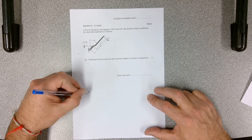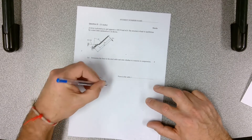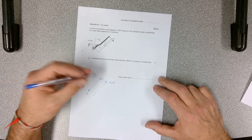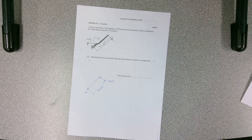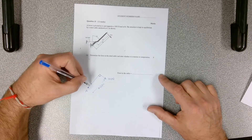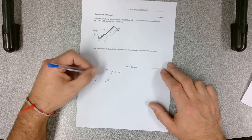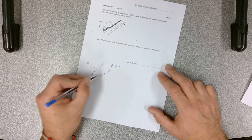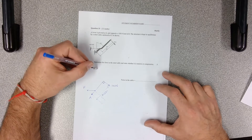We can do a free body diagram to simplify it. Our pivot point is point A — that's our lever. Our force is 100 newtons and it's at right angles to the lever, which is nice for us. The distance of the pivot is 0.153 meters — we convert to meters. Our steel cable is the force acting into the wall and it is not at right angles to the lever.